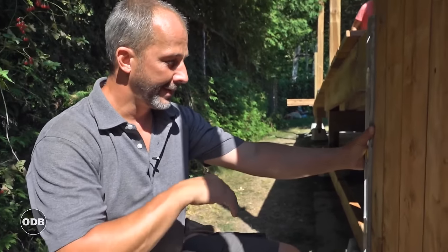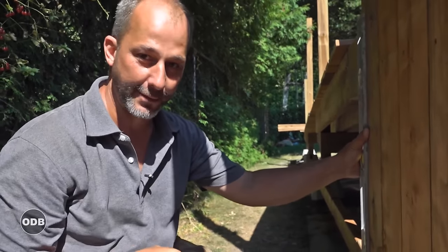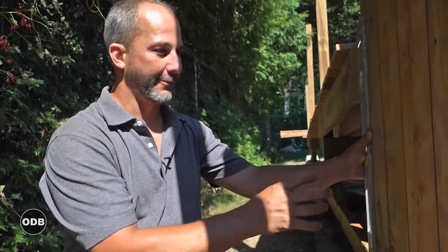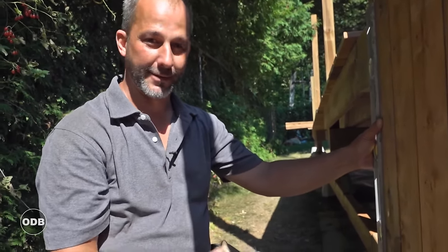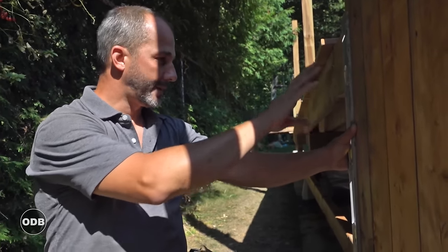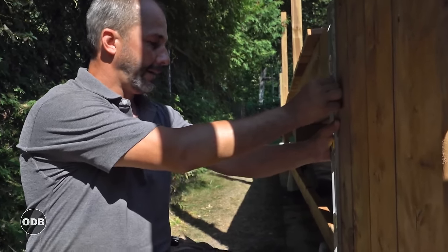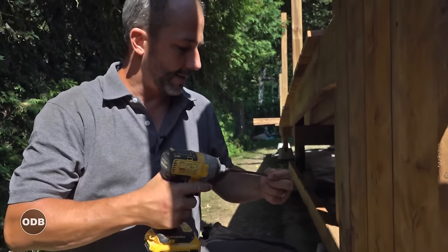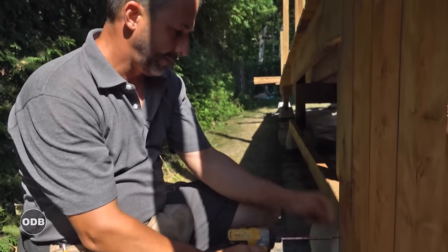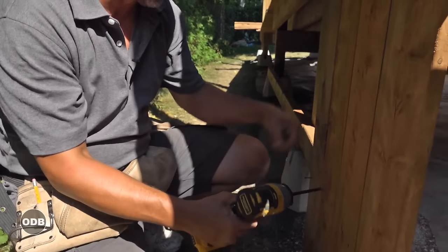Here's a tip: when doing skirt you can't just put the level on the first board and then install 60 or 70 boards and expect it to stay straight. Every piece of wood coming out of the mill has different texture and grain and holds different amounts of moisture, so they warp and bend. You want to take a level every two or three boards and confirm you're on track, and make any adjustments now — just adding myself a thirty-second of an inch here.